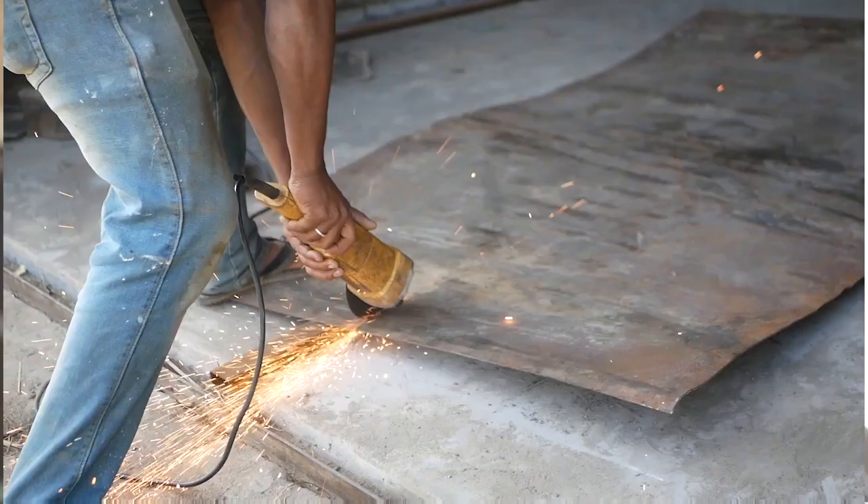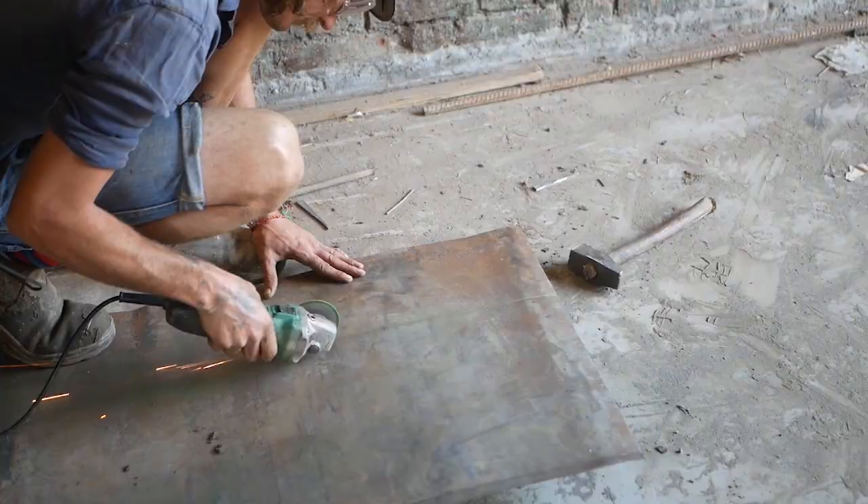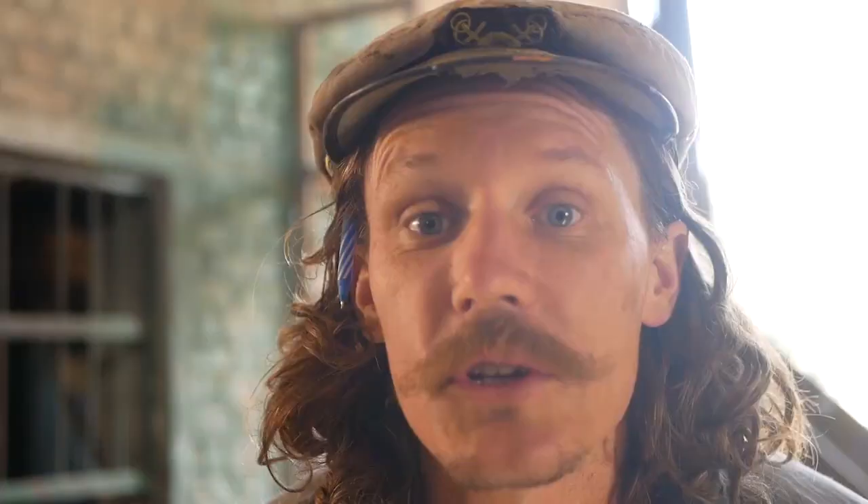You want to cut that sheet metal in half, cutting it lengthways so you get a long strip — it's about 600mm wide. Next we're going to use the guide from the Playground Ideas designs to measure out where the cuts are going to be in this sheet metal, and then we're going to bend it up so it gets a nice gradient curve going on there.